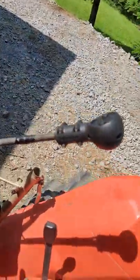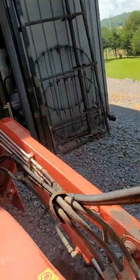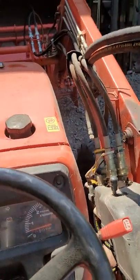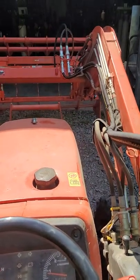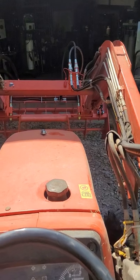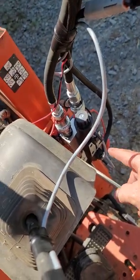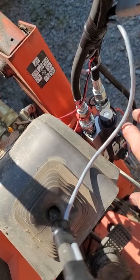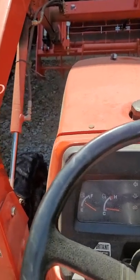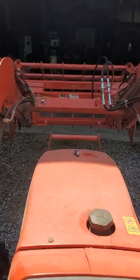From the seat you can see how the lever works. It's just got two push buttons. I'm really happy with it. I set the grip and it's pretty comfortable — you just have the two buttons right there. When you start up you can normally raise and tilt, and then when you want to grab something you use those buttons. One button opens and the other closes. Depending on how comfortable I get with the button placement, all I have to do is unplug and swap those wires into the control valve to reverse the two buttons if needed. It's no big deal.